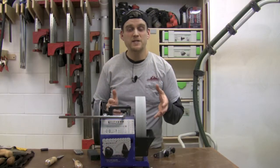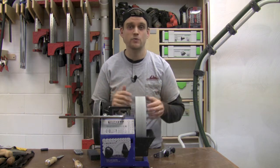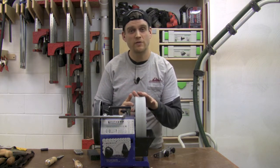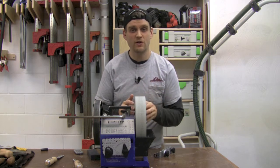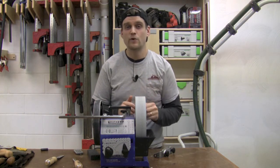I was able to take a brand new factory chisel all the way to a highly polished razor sharp edge in really just a few minutes of work. If you have brand new chisels or ones that have dings or nicks in them, you start with that rough stone and reset the bevel angle, then switch the stone over to 1000 grit and start polishing that bevel, then take it over to the strop and get that razor sharp edge.